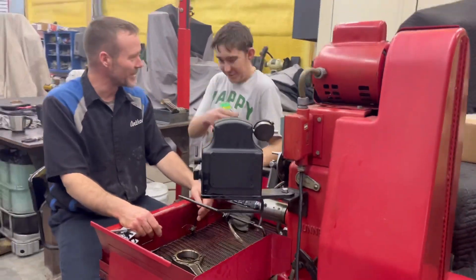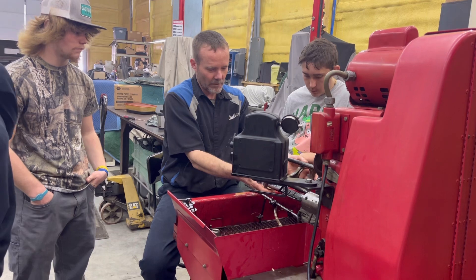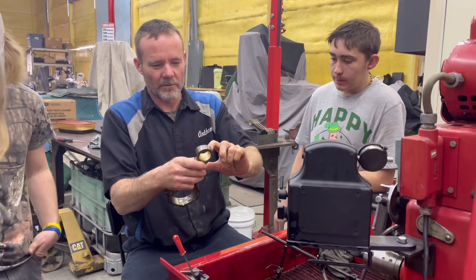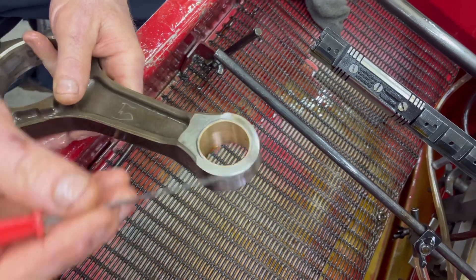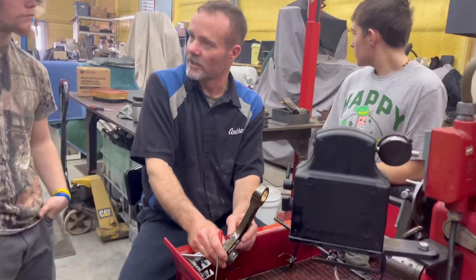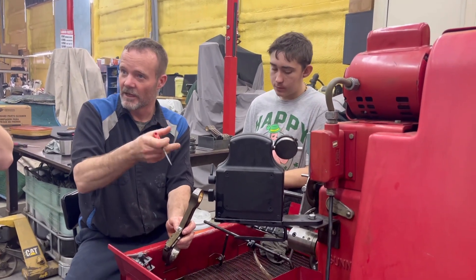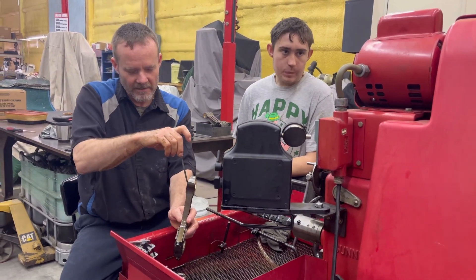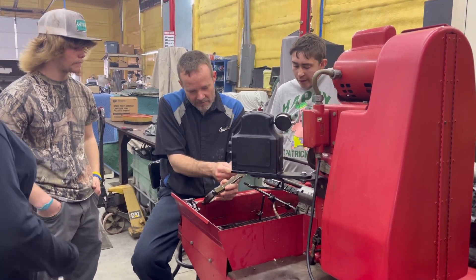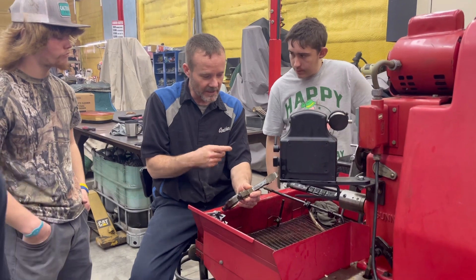It costs us all the time, because normally you'd put this bushing in, chuck it in a different machine, and hone this hole exactly where you want it — we would actually cut it. This is honing; this is just scraping across it, knocking crap off. That machine has an actual cutter that will move that hole where we want it. Put a little cup right here for donations to get a better machine — because we shouldn't have to hone it this long. Normally you'd take like 10 thousandths; we're taking 30. It doesn't cut through the coating though. That's the coating — that's what we want that pin to touch. Brass is kind of like nylon — it's considered self-lubricated, like plastic on metal. They call them self-lubricated. As long as we don't cut through that, and those are done and didn't cut through it, it works.